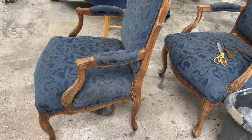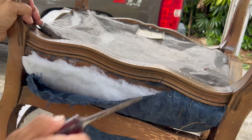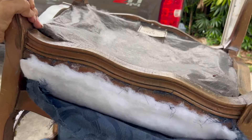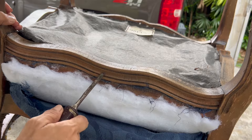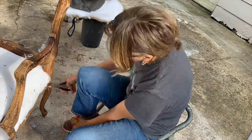Leave them hanging out like that and then just pull them right out. If they're not easy, just leave them in and hammer them down. For taking off the fabric, I use a chisel — get it underneath and pull the fabric off all the way around, which works very fast. I don't have to worry too much about the wood because this is in terrible condition and I'm going to wire brush it down to the raw wood.